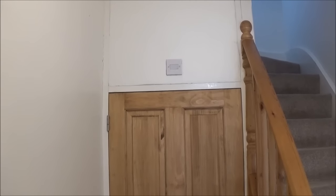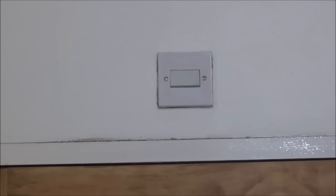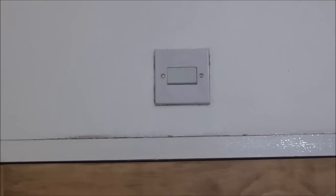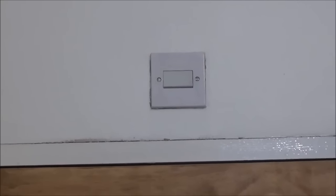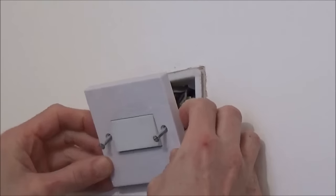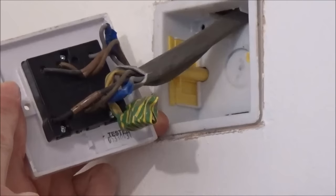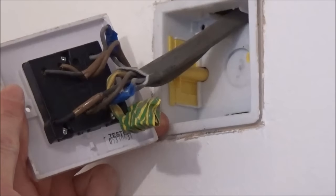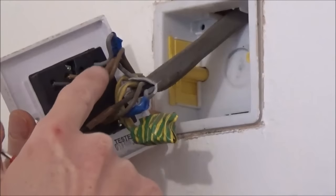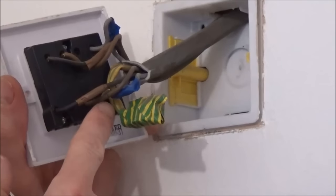Here's the three pole 10 amp fan isolation switch, located above the door. The reason for this is safety — if you isolate that switch and go to work on the extractor fan, it's not in an easy location for somebody to switch on by accident. If it were located down with your light switch outside the door, somebody might accidentally turn the power back on while you were working on the fan. Inside the switch, you've got three inputs into the top and three outputs at the bottom. The three core and earth cable from the ceiling rose connects here — grey marked with blue tape (neutral), brown (permanent live), black with brown tape (switch live), plus earth.